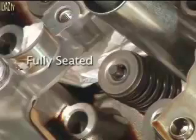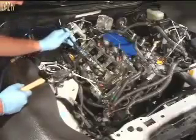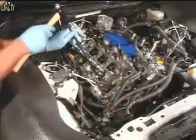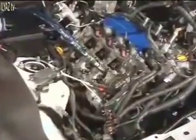Repeat these steps for all valves in the cylinder. Place the valve keeper seat tool on the keepers and lightly tap the tool a few times. After removing the tool, visually inspect the installation of the keepers. After finishing all the valves for one cylinder, rotate the crank to raise the piston in the next cylinder to be repaired.